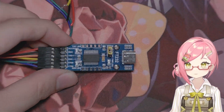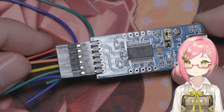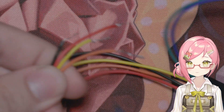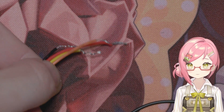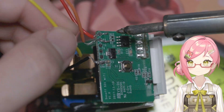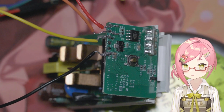We're going to flash the firmware with a simple FTDI adapter, which allows us to flash through UART via USB. I bought a generic one online, so yours may not look the same as mine, but they all do the same thing. The only pins we're interested in are VCC, ground, TX, and RX. This part is important and was left out in the other video I watched, which left the comments section quite confused: the TX on the adapter should go to the RX on the plug, and vice versa. Now I simply solder the wires on.